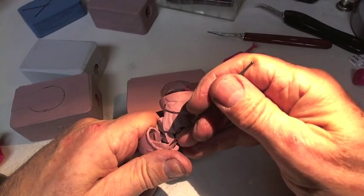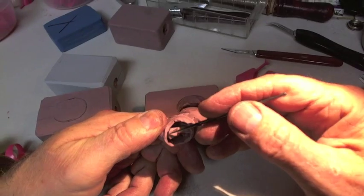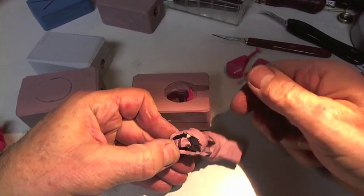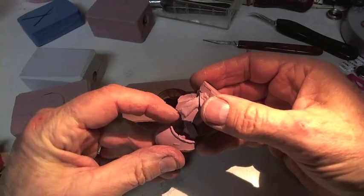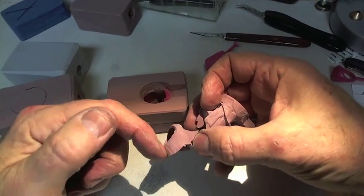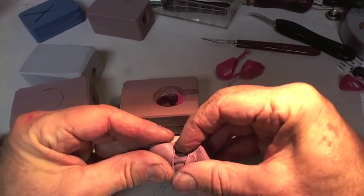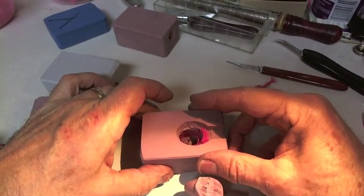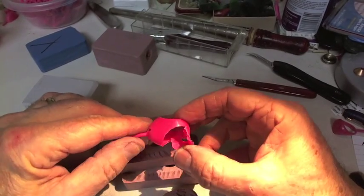My big mistake here was to cut too narrow a spot here — I should only cut that far. But the biggest mistake was that I did not attach the spaghetti to the bottom of the inside of the ring. This right here should have been attached right there, so that when you pull this out of the mold, this part gets turned inside out and pulled out. The inside of the piece is quite flexible, so if you can get it to unfold inside the mold, it leaves a really beautiful wax that pops right out.